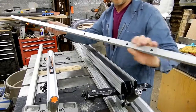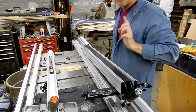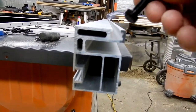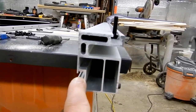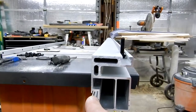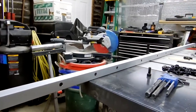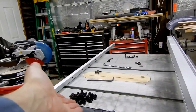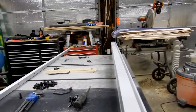The main thing I was worried about was the holes on the back lining up, and I checked — they line up perfectly. Installation is extremely easy: it uses a t-track system where you put a hex bolt in and line it up to your existing holes. There's a t-track underneath for the power switch as well. The holes on the front rail pretty much line up to the holes already on the saw. They supply all the hardware — all bolts and nuts. I'm going to do a time-lapse on installing the back.